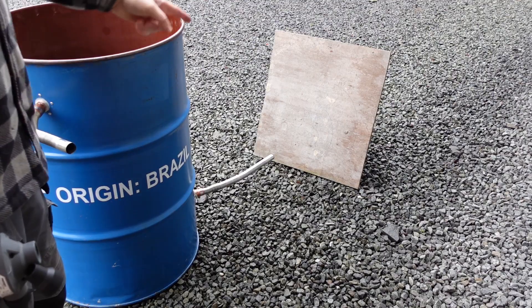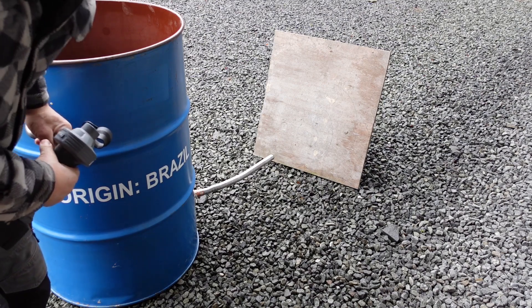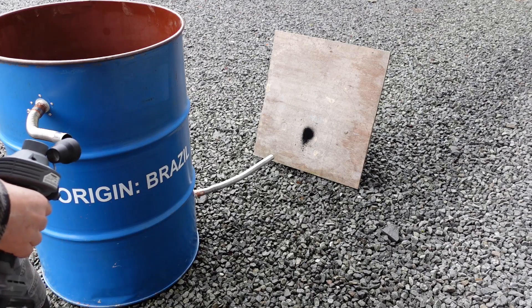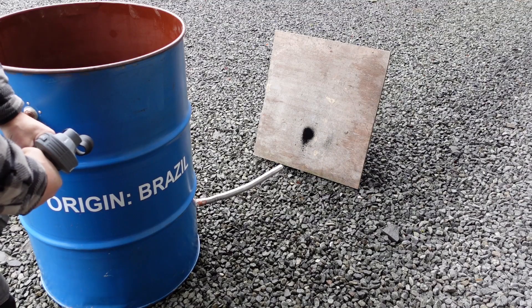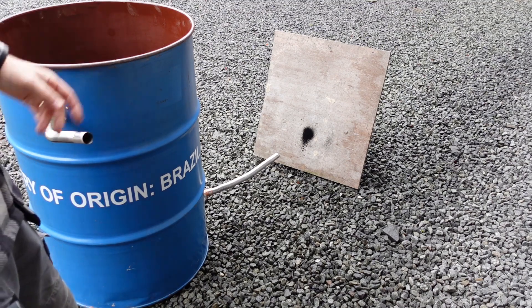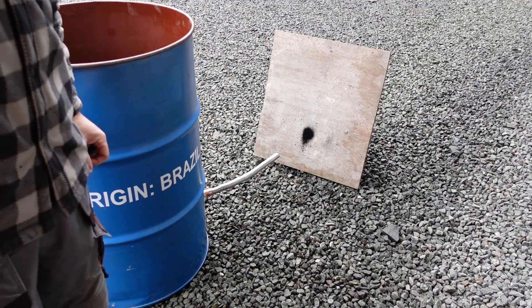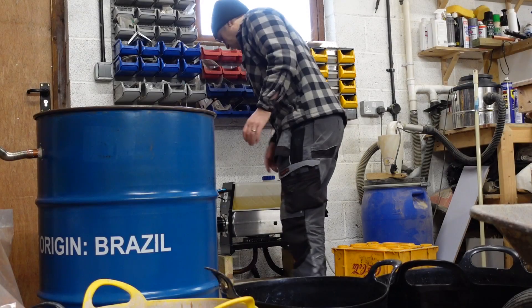While that's running we'll see how much soot's in here. Let's see if we can score a bullseye - hopefully it's still running because this is a one-and-done situation. It's not like it's a compressed airline so I'm guessing we could get more out with compressed air. If you're looking at doing this, 25mm stuff at six meters is too long - they don't like it. I was getting no soot before with just the shorter run, so I think I've got to look at going up in size. Maybe inch and a half - people have commented about inch and a half. I think they were right. This is a lot cheaper though - about 150 quid for inch and a half for six meters. 205 degrees - we're getting there.